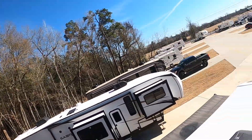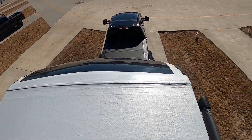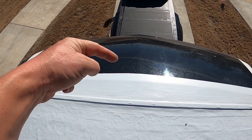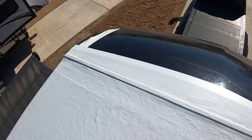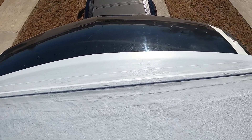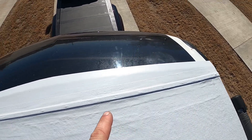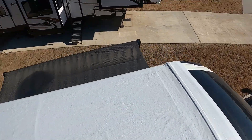I figured I'd come up here and check out our roof and give you all an update on what's going on. Let's go over to the front cap. This is what it looks like now — you can see they extended well beyond the front cap seam and they actually put their membrane down, which is kind of like a fiberglass batting, and then coat their two primer layers and their final coat on top of it.